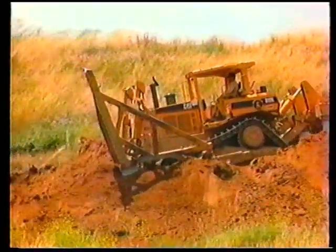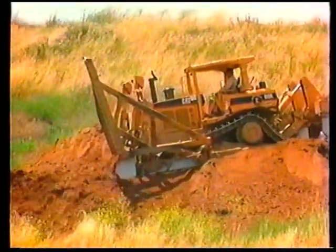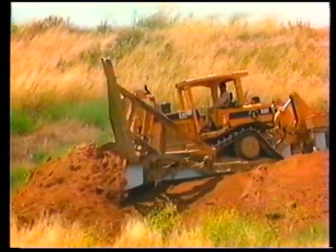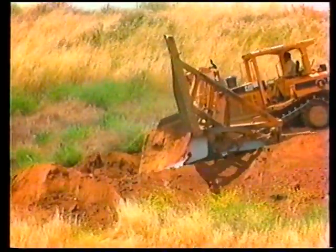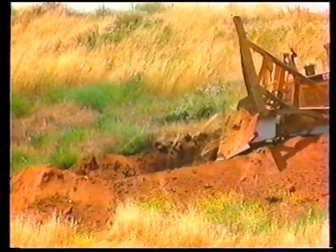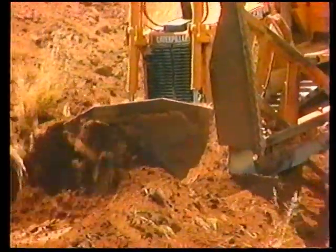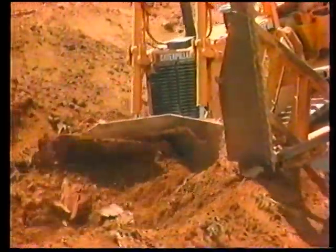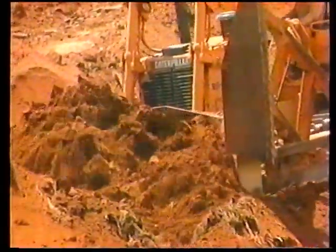Tilt the dozer toward the inside at about a 5-degree angle and start forward benching into the hillside. This will keep the dozer leaning to the inside slightly and shift most of the weight away from the edge. This creates a much more stable condition. You want to load the dozer with as much material as possible and then turn toward the outside edge. Lift the dozer slightly and cast the dirt over the side, creating a footing thick enough to support the machine.